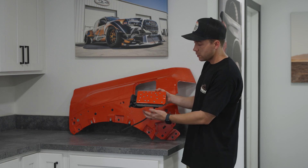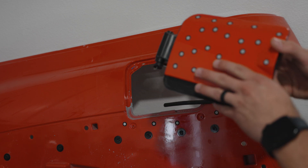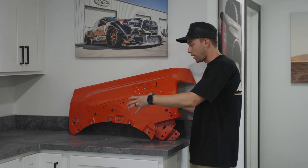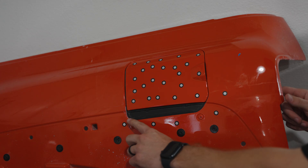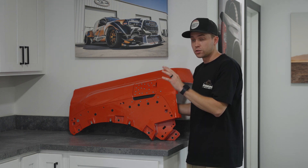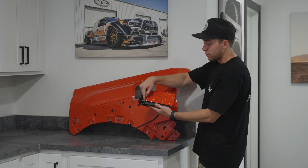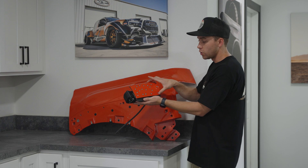When we designed the kit we had a great idea, but along the entire process where we ran into hiccups was the gas pod. This is the actual Bronco Raptor gas pod — you'll notice the door ends right here and there's still this exposed piece of plastic. When it sits inside the factory Bronco Raptor panel it sits pretty nice and tight, and then there's a line that follows all the way across where the rear flare attaches. The difficulty is we don't have a secondary rear flare, so we had to hide this section. We added just this opening from here to here with a secondary bracket on the back side that gets glued to the panel, so the gas pod only shows the door and it looks incredibly clean.